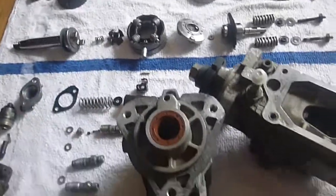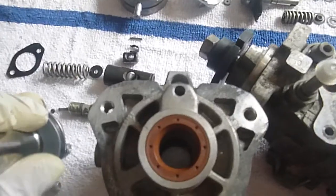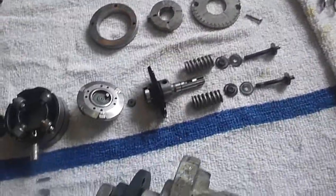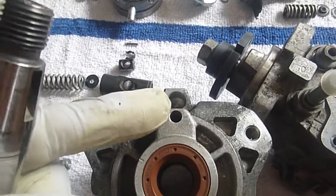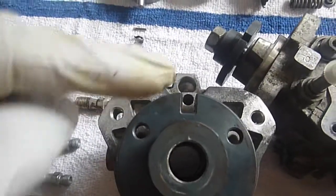So let's get it right the first time. Those screws actually go on the end of this shaft — the washer and the large, I think it's 24 millimeter nut goes on the end of the shaft to pull this hub into this conical shape and stick it to the shaft. As you assemble the front end of the pump and lock down these screws, the next thing you insert is this main shaft. This main shaft is supposed to go into the pump straight. This is the lock pin assembly — when you're doing your timing on the car with the timing belt, you lock this sprocket hub onto the shaft with a pin that goes through here.